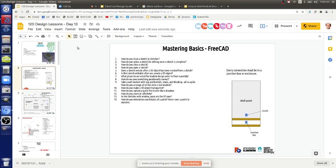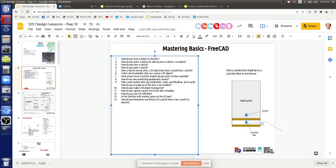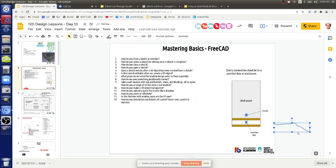What we're going to have is wires going to the, from your electrical breaker panel, the main panel which the fat pipe from the street goes into, you're going to have one wire out of one breaker going into this junction box. And this wire here is not there yet. We're going to put it in later. But right now, we do want to put in this wire from this junction box. We're just making a point of connection. So we'll have a wire going to here, an outlet plugged into this electrical box.